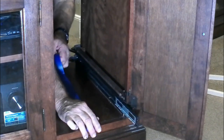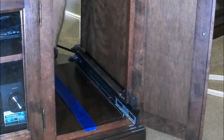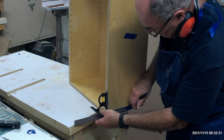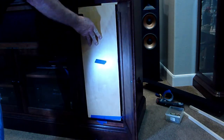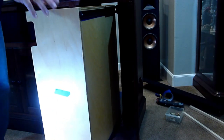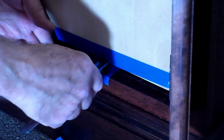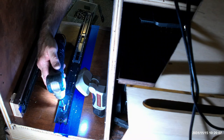I'm installing some blue tape down the center of the bottom panel. This way, if our drawer fits well in the cabinet, we can mark our center reference line for the bottom slide. Put a reference line at the bottom of the drawer front and then scribe our center line down the length of the drawer bottom. Finally, we are ready to dock. If it's mounted properly, it should slide easily in and out of the cabinet. Now check out that wobble with just two slides — that's why we use three. Now that we have a good fit, we need to plot and install the bottom slide. From here on, the procedure is exactly the same as for the frameless cabinet we fitted earlier, so just follow those instructions step by step.